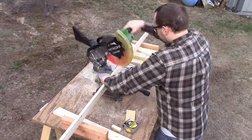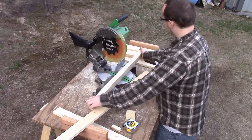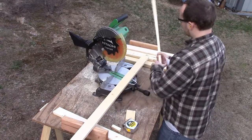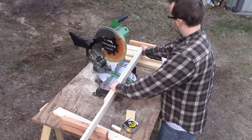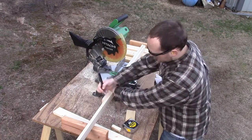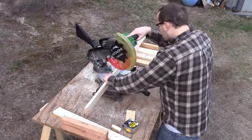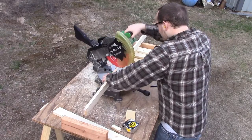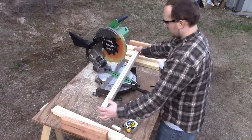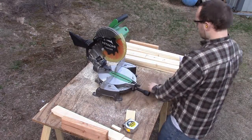After cutting each one, compare the template leg with the new one by feeling for a difference in length with your hands. Since these legs will adjust to uneven surfaces once they're bearing some weight, you don't need to worry too much if they aren't all perfectly flush, but if you do your best now, you'll thank yourself for it later. And once you've got all the legs cut to your satisfaction, set them aside and swap out your compound miter saw for your table saw.